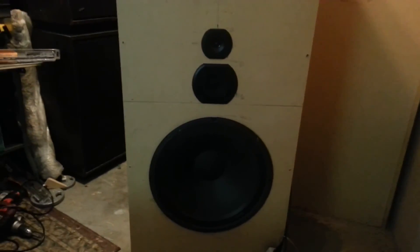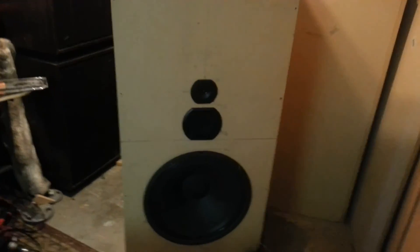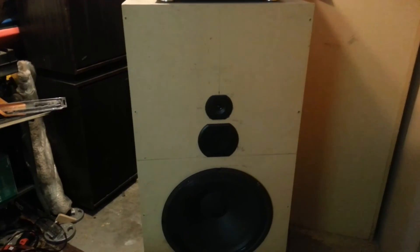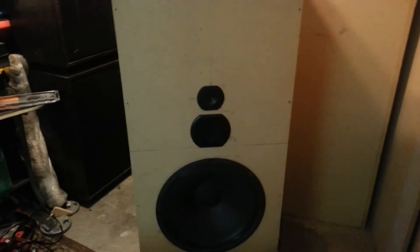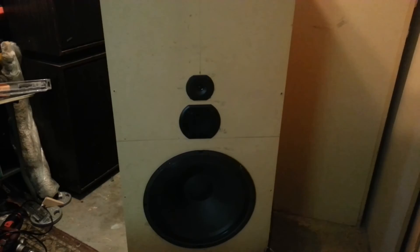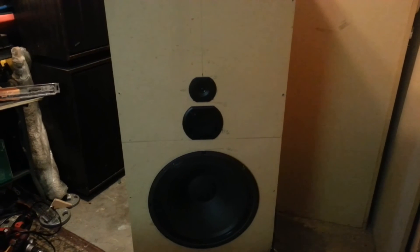Overall I'm pleased with it. I still need to do a little finishing — I've got to finish off the exterior of the cabinet, add more internal bracing. There's still some cabinet resonance here and there, especially when I do a frequency sweep — you can hear certain parts of the cabinet vibrating. I'll add an end to this video when the cabinets are finished, painted, and I've got all the grills built. I may upgrade the mid-range and the tweeter. Thanks for watching.